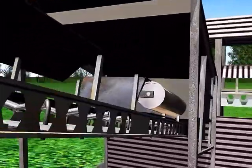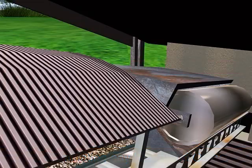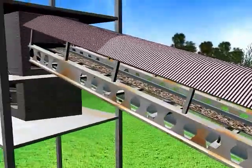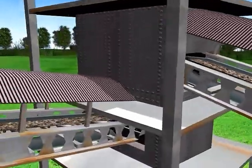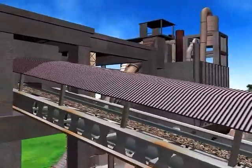After the hopper, material is passed onto the magnetic separator for eliminating any unwanted objects. This process is essential for eliminating iron particles from the raw material. From the magnetic separator, limestone and laterite of 80-100 mm size is fed into the mill with the help of a conveyor belt.